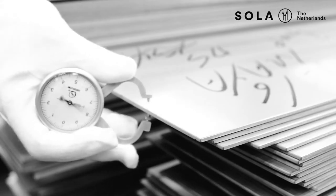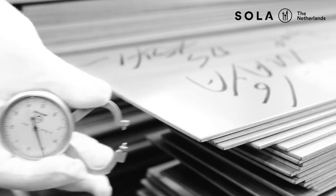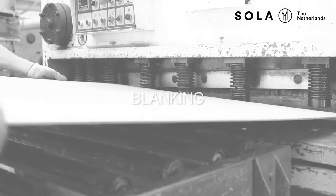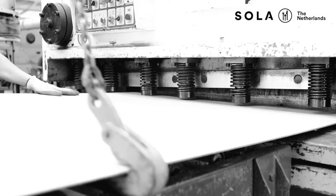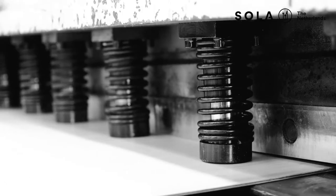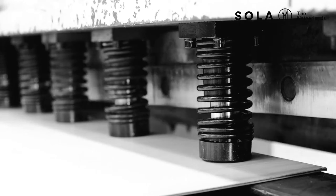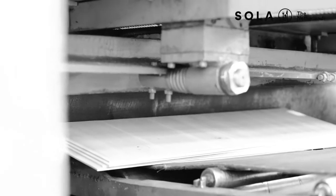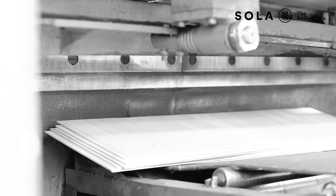The amount of steel ordered is calculated very carefully by the factory managers. The next step is blanking. You can imagine that you can't lift or work on this coil, as it is way too heavy. Long parts are cut from this coil and the blanking process begins. Blanking is the cutting of the large coil into smaller, more workable square pieces.